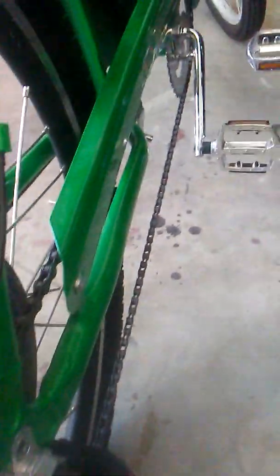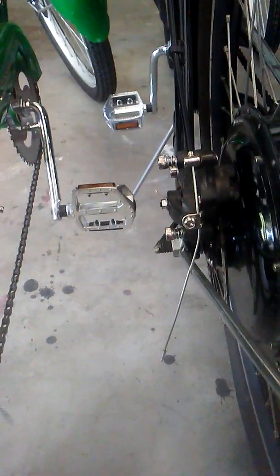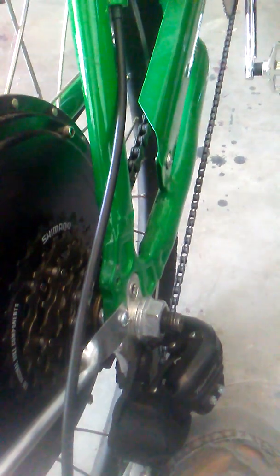If you're sitting in a wheelchair with a tire on each side, you've got a freewheel driving each tire. When you push one lever it turns you one way; push the other lever and it turns you the other way. But you want both levers on the inside of the tire, which means this whole mechanism needs to be mirrored — so the freewheel needs to be on the inside, on the left side of the wheel. I found left-hand freewheels online for $20.